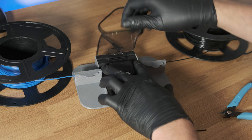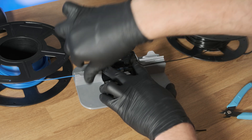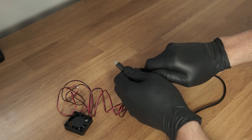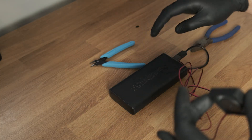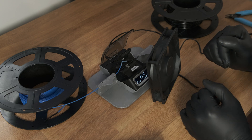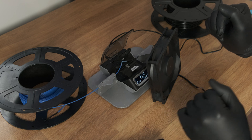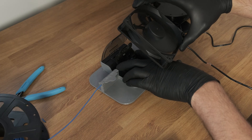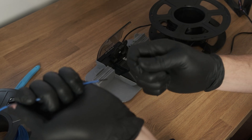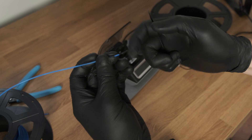I tried a technique of removing the power, placing my fingers either side of the filament, then opening the lid very slowly — all in an effort to stop it from moving and deforming. This kind of worked, but even though I was as delicate as I could be, the slightest movement formed a bump on one of the sides. So I MacGyver'd a small fan I took off one of my Ender machines, but I could barely feel the airflow, most likely due to my limited electrical experience, so I swapped to a PC fan with a USB cable already installed. I ran the fan as the unit heated up to see if it would affect it, but it didn't, which was good. I got some pretty good results — so good, in fact, that when I was testing the strength, the fused parts held out stronger than the filament itself. But it was annoying to have to place the fan, and if I was going to use it as a permanent solution, I would have to incorporate it into the design, which would be time-consuming and annoying.